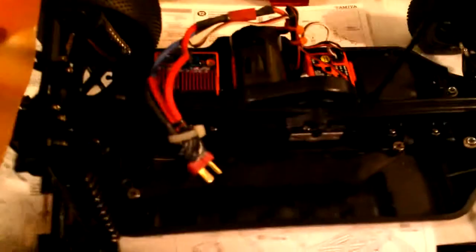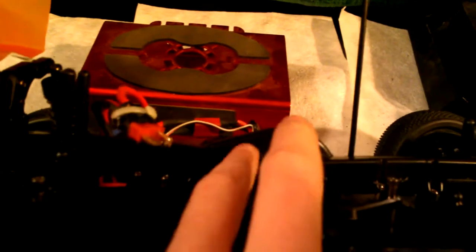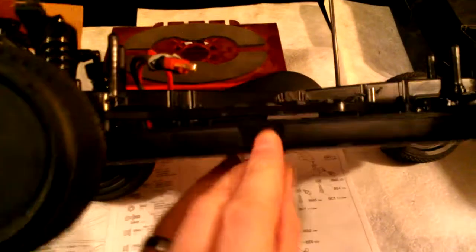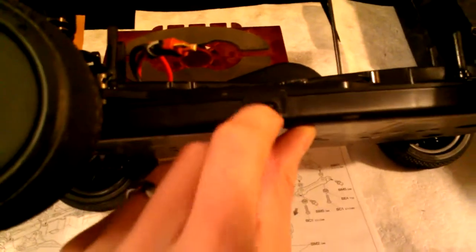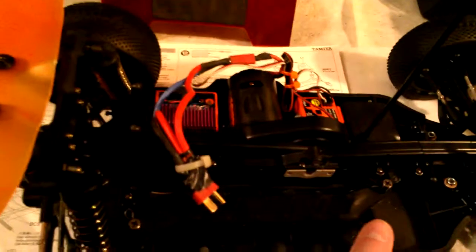The motor mounts inward this way, right? So if you want to do gear mesh, you got to take off, I think, one or two of these halves here of the belt cover, and then there's a little hole down here, and you need a long screwdriver to come in there, and then you got to come in also on the top of the screwdriver to undo the motor screws. Okay, maybe that's just a consequence of having the motor mounted the way that it is, but that's also probably why other designs don't have the motor mounted like this.